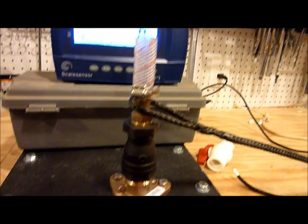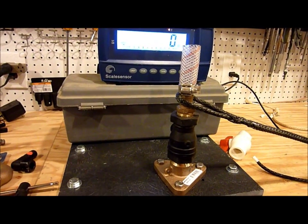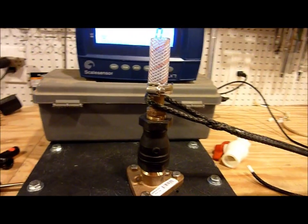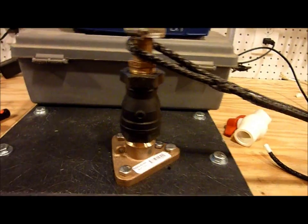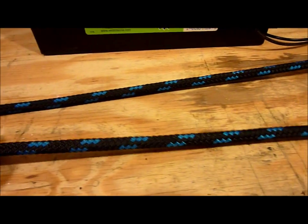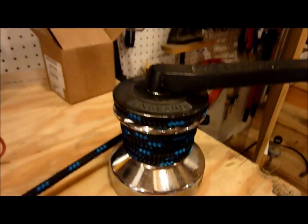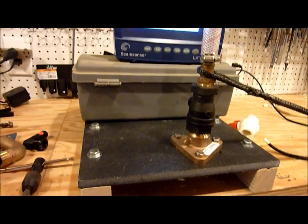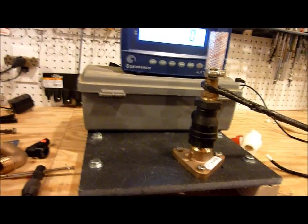I want to see how the Marilon valve does compared to the drilled and tapped bolts. This is a three-quarter inch Marilon valve with a Groco flanged adapter in bronze and a bronze tailpiece. I'm using Dyneema rope for less stretch, going to a block — Yale Vision, which is also a low stretch line, I believe Vectran — and then off to the self-tailing winch.